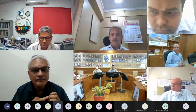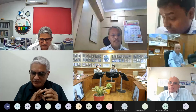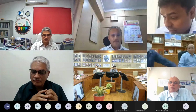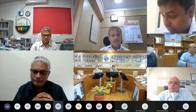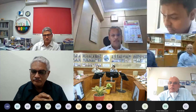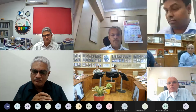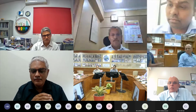Sir, I am Ranjit Singh from CPWD. Sir, I have a small question. Now, this full scale testing appears from your presentation. Apart from the requirement given in the portal, we have to test the new technology with full scale testing also. And not only that, it appears that even the conventional system should be subjected to full scale testing. Is this provision part of our seismic codal requirement, or are we going to make it a requirement in the seismic code?